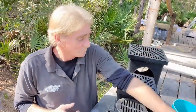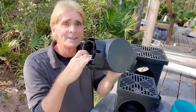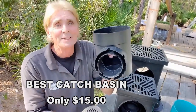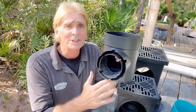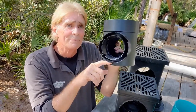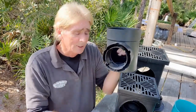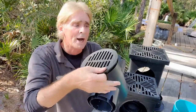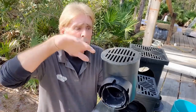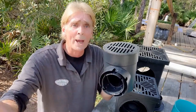Let's take a look at what a catch basin does. Here's three different kinds. My favorite is this little six by six round catch basin. A catch basin is exactly what the name says — it catches debris. You can see this little space down here underneath; this is where the discharge pipe comes out, but the debris sits down in the bottom. You put the grate on the top. This goes in the low spot of the yard. When it rains hard, all that water pours into the basin, and the pipe carries it away.